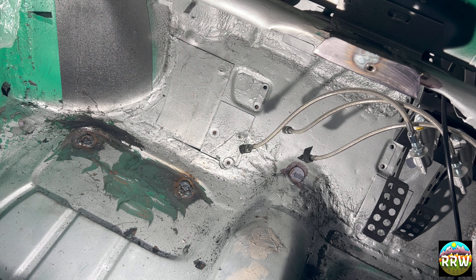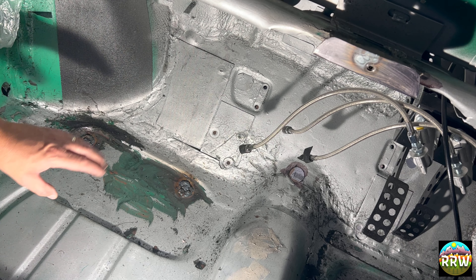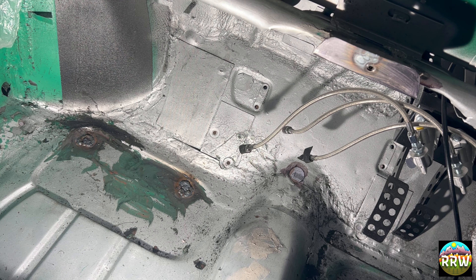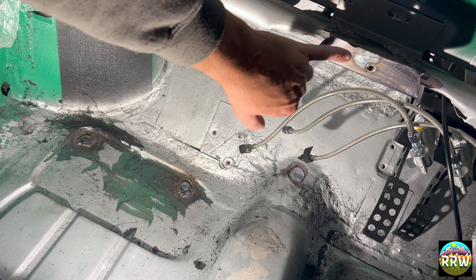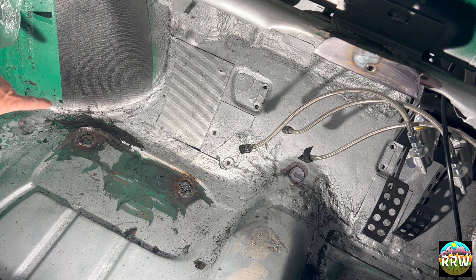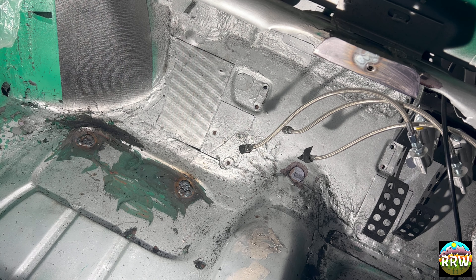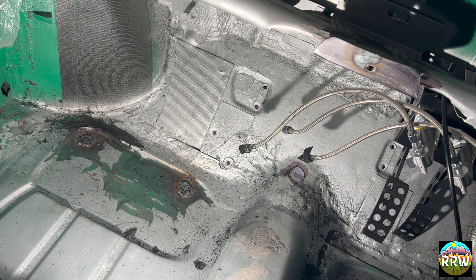Now they are not perfect, but the actual material on this original floor does get quite thin so I've had to puddle it out a little bit, but they are getting flatter. So if you have only just tuned in, I've only just bought my welder and I've only just started to teach myself how to weld. Put a captive nut just in here - got great penetration as you can see just here around the top edge, that's locked in and secured. But yeah, we're getting a lot more puddling than mounding, which is great - so less to grind off. We've chased that out, we've put a nice sip washer in there, filled up the center, we're going to grind these back and see what they look like. So a bit more time lapse, bit more tunes, and let's crack on.